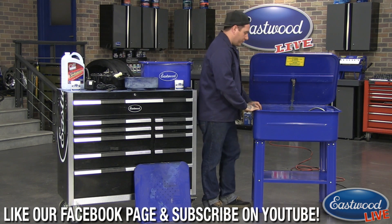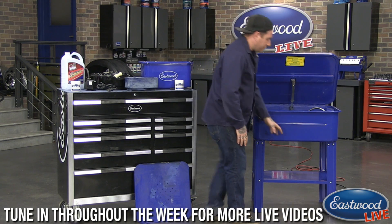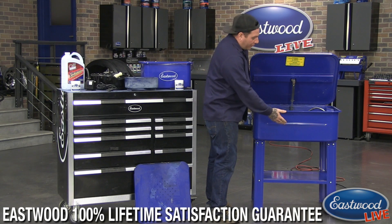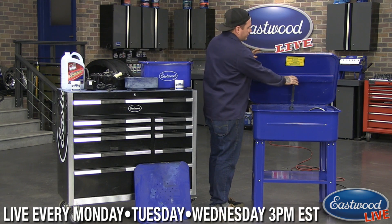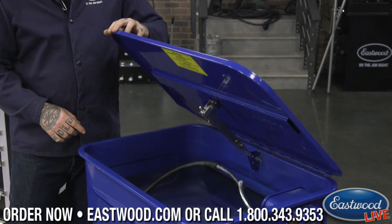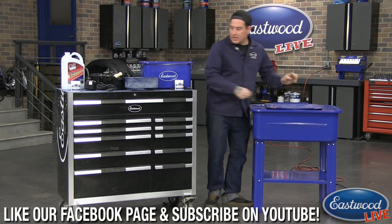The filter is reusable — you can wash it out and continue to reuse it as long as you're careful. There's also a drain plug in the bottom, which not all units have, so you can put a bucket underneath and drain out old solution without tilting the whole unit. For safety, it has a fusible link built in that will automatically close the lid if a fire occurs — a great little safety feature.